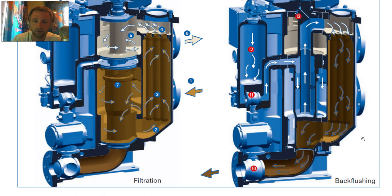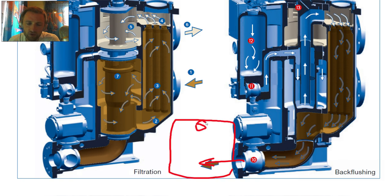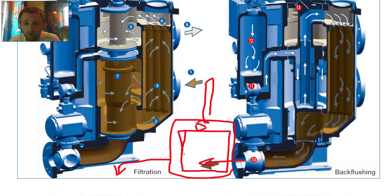There is another thing to mention: after the outlet, you can install another filtering cartridge with differential pressure — which is an optional selection for this kind of filter. What it does is collect the oil which was blown out and back-flushed, filter it again, and then send it down to the sump. So it's a kind of second-stage filtering. I have seen that kind of system, but not with differential pressure and not with air — just a filter. It was a box which you can open with a cover on top secured with butterfly fasteners. The oil falls down, passes through a mesh filter, and flows down to the sump.